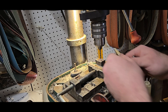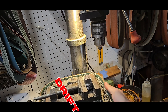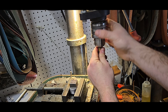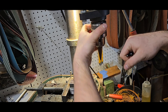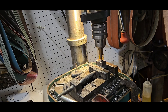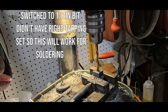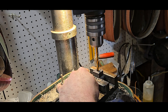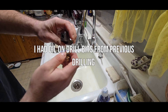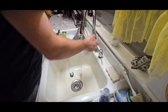These are cast mild steel, so getting a drill bit in there and centered is not going to be easy — it's better to go from the top. After you get that mark, go from both sides to give a better reading. It's going to be hard to see but we do have a rough center point where the lines intersect. Spring-loaded center punches are awesome — I'll leave a link in the description. Now take it to the drill press and use a step drill bit — this will make the center hole better and it won't drift. You can get these from Harbor Freight or Amazon. Then clean the threads with a soapy towel to remove any oil so we get a proper solder joint.